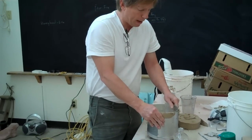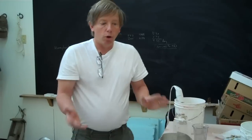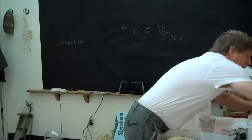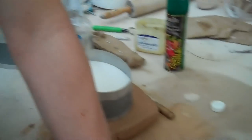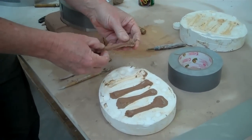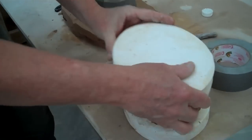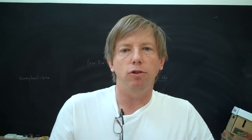So now I will put this mold back on here, this jacket, put my tape back on, and then I would make another batch of plaster, pour it in — and that's how I make my mold. So what you'll see here is a finished product, which I've then pushed clay in here, and I can get my little bones out like this. You just push it on — you'll see these registered lines will line up, you push clay in there, and then there you go. That's a down and dirty way to make two-piece molds.